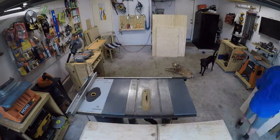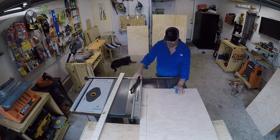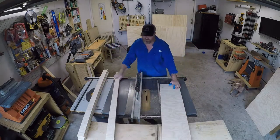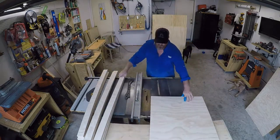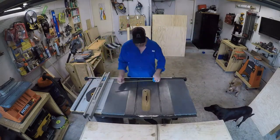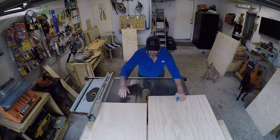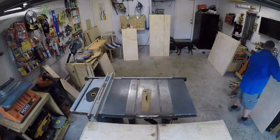Back in the shop I'm going to start breaking down the sheet goods. I'm first going to cut ten two-and-a-half by forty-inch pieces — these are going to be the under rails for the X-Carve table and the side rails as well. Then I'm going to cut the cabinet sides; I need three pieces. I'm building a cabinet and a winged end, cut at thirty and a half by twenty inches deep. And while my saw is at twenty inches deep, I'm going to cut the bottom shelf, which is sixty-three and three-quarters by twenty.